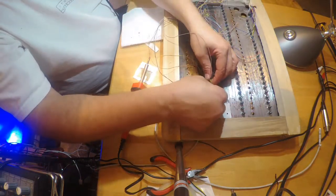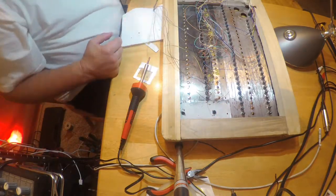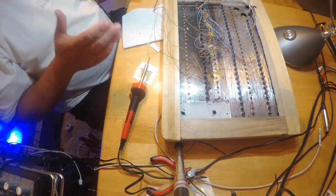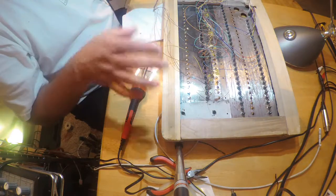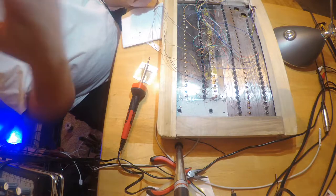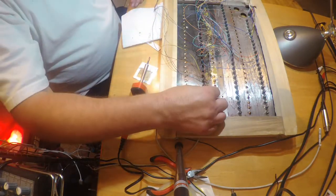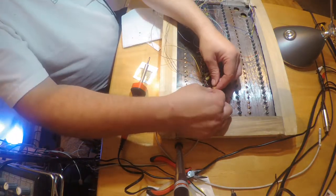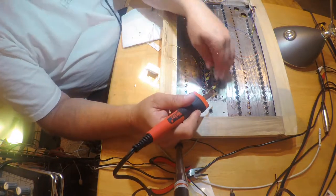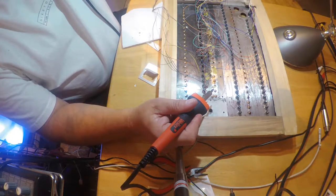And I'm going to, of course, disconnect these old LEDs, and I'm going to put in some bicolor LEDs. So the reason I'm putting in bicolor LEDs is when the system is not in the arm position, they'll show up green. As I'm loading the effects into the board, they'll just show up. I don't have to turn the board on. The power supply has to be turned on, of course. So, let's see. Let's zoom in a little bit.